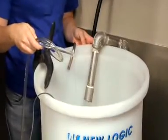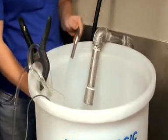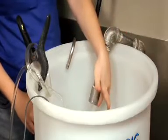At this point, you can see Kira has steady permeate flow out of the unit, as well as steady concentrate flow out of the unit, and there should also be bypass flow out of the unit. Run the system for 30 minutes to verify that there are no leaks. After you've done this, you'll be ready to start the Series L test.